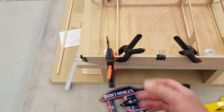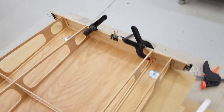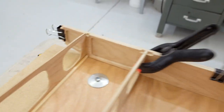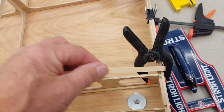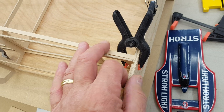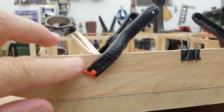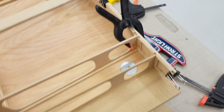I do my transom in a kind of two-piece format. I stole this idea from ML Boat Works — this is the way theirs is done. It's all solid when they get it, but I cut it out on the sides to make it lighter. I like it done this way because when I put my rails on here, this is gonna be my rail that runs along my engine well to glue my deck to and offer support. It hits the end here and then I have my second piece on the back, and you don't see it exposed, so it makes for a really nice-looking solid transom without trying to fill in holes where you've notched it for your stringers.